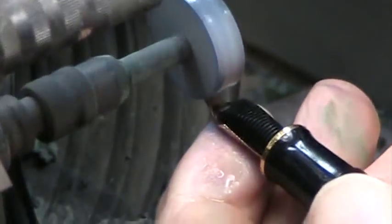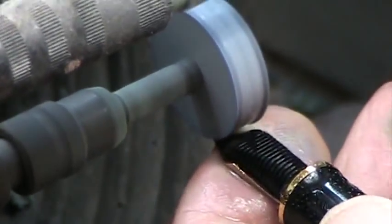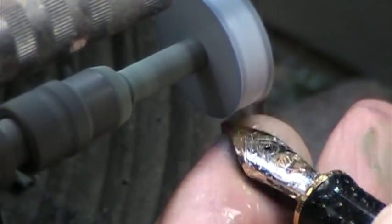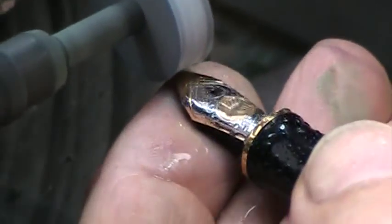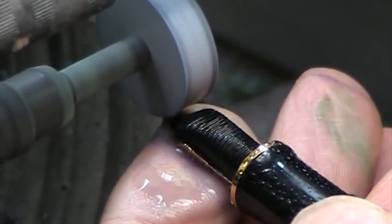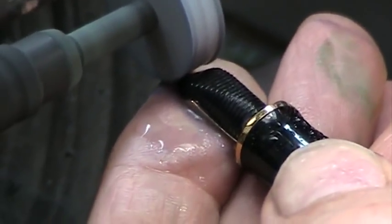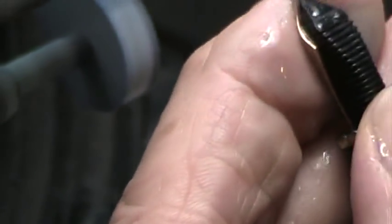Now I'm going to go to the next level of wheel. That was a diamond wheel and this is a little less aggressive and a lot smoother. I've got a fresh wheel on here so it's cutting really well, still with the water. I'm basically duplicating what I did on top and refining it with bevel cuts. The top cut was like that to give good polish — that's entirely aesthetic. The bottom cut takes a bit to remove the hard marks of the diamond wheel because it was a very coarse wheel.